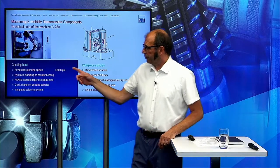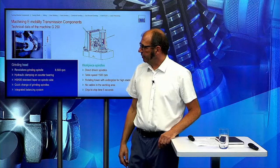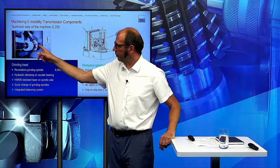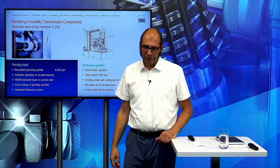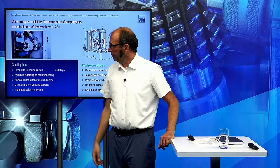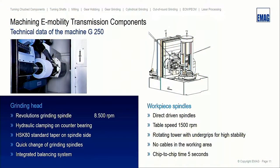I've told you before that we are using a grinding spindle and tool arbor here. So on this side, where the motor is located, we have an HSK cone 80, and on this side there is a cylinder on the tool arbor, and we clamp this with hydraulics, so this is absolutely stiff. We can drive this spindle with 8,500 or 12,000 RPM,